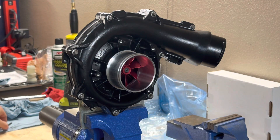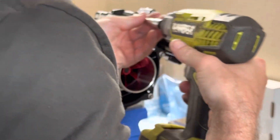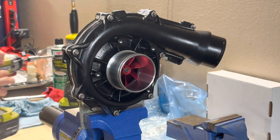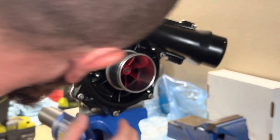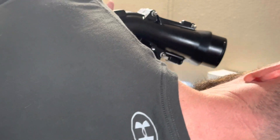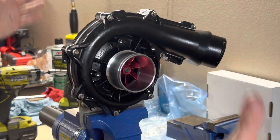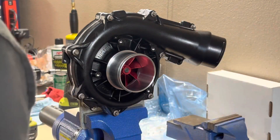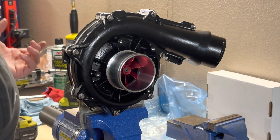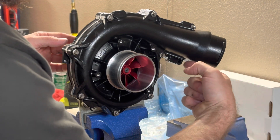Looks like we've got an issue with our plate. I'm going to back some of these off. This is why I like to do this in real time — not everybody gets to see the challenges that can come up. It looks like the hole for bolt number nine is being blocked by the plate. I'm going to have to take this back off and check that hole. That's probably something I should have checked earlier — not just alignment, but making sure all the holes were drilled out properly for the bolt to pass through. The bolt started to bind up and is actually hitting the plate.